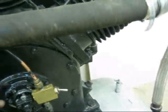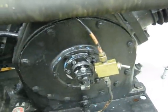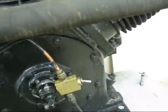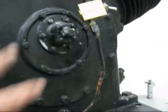And it does it with oil pressure. When the crankshaft and the compressor is not turning, the oil pump's not turning, and this valve lets air pressure hit the unloaders. But something's wrong in there, so I'm going to use an electric solenoid valve here to control the unloader instead and just blank this off.